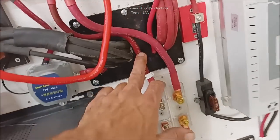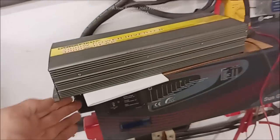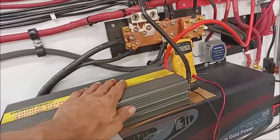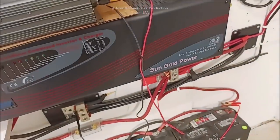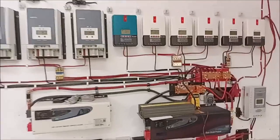This one over here is running with 4-gauge wire, this one's running with 2-aught and 2-gauge on boom, running over here to this one for 240-volt double phase. And of course this one's going back in a box or out there to run the electric lawnmower. My wife uses this one in the pickup truck with 200 watts of solar on the roof to run her electric lawnmower for hours — which is good, I get to stay in here and do this stuff in the cool.